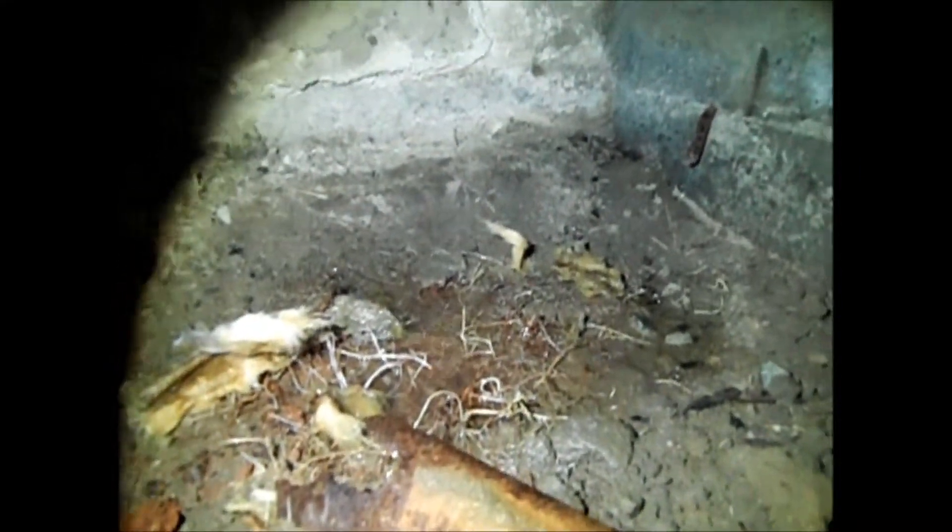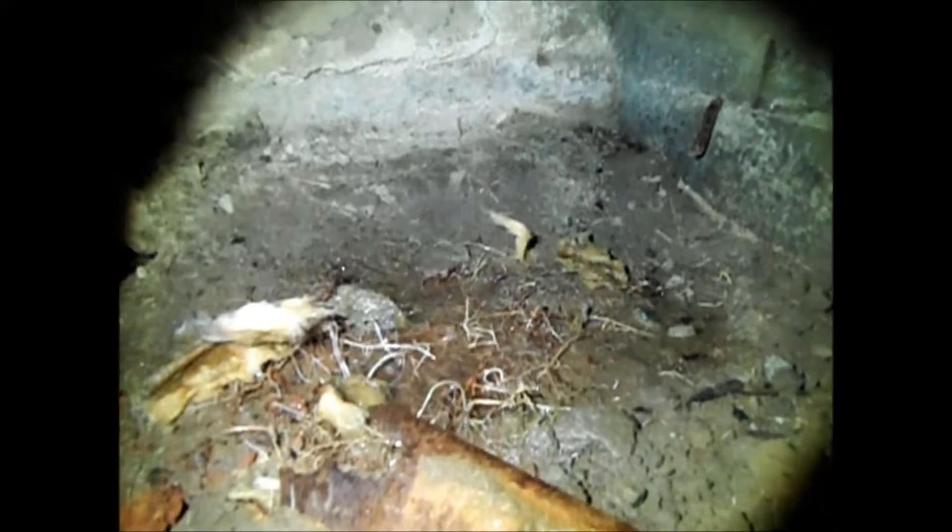I'm under the house in the water heater area. You can see water leaking here — it comes from the drip pan under the water heater. There you can see the pipe where it's dripping from; the bottom of the drip pan doesn't extend all the way out.